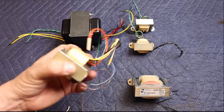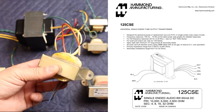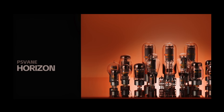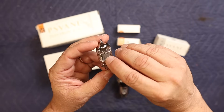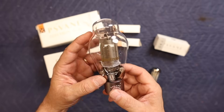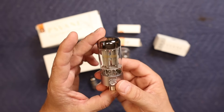Staying in the Hammond theme, we're going to use the Hammond multi-tap output transformer, the 125CSE — 8 watts rated at 60 milliamps. It has separate different types of windings so you can choose different primary and secondary impedances. All the tubes in this amplifier will be from the Psvane Horizon series, considered their budget-friendly tube set. The 12AT7 has some external bracing which I suspect helps with microphonics. The 2A3 is quite stout — its envelope is almost the size of a 300B. And the 5AR4 is a new release from them; I'm interested to see how its voltage drop compares to new-old-stock 5AR4s.